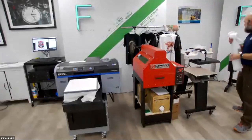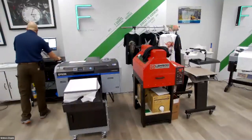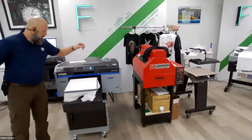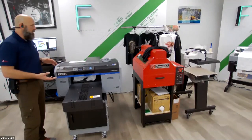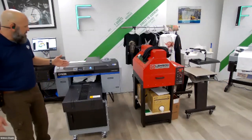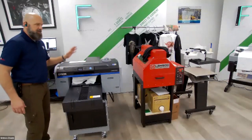The machine between us here is a pre-treat machine. If I was to print on a darker garment, it would require pre-treatment before printing. I'll go ahead and open the geckos file and hit print on my machine. The platen height is adjustable — if you're printing a thicker material like a sweatshirt, you'll probably have to lower the platen to account for the thickness of your fabric. As it takes the shirt in, it's reading and sensing the height of the platen. If set too high, it will beep rather than crash the head — it's a fairly foolproof system.